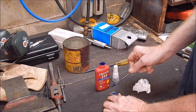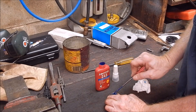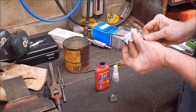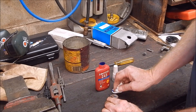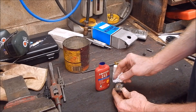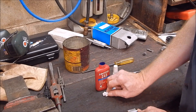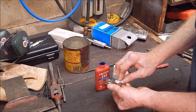With these magnets, you never want to over-tighten them because you can crack them. You never ever want to try and drill them because they'll shatter, and even a die grinder on them isn't a great idea — they can fall to pieces on you. Looking good, not bad for a bit of junk. You can paint it if you want — I personally wouldn't bother, because it's going to be banging around on the lathe with cuttings and stuff. I'll just put a bit of oil on it and she'll be good to go.